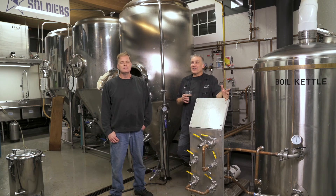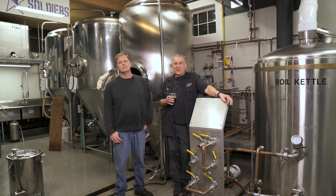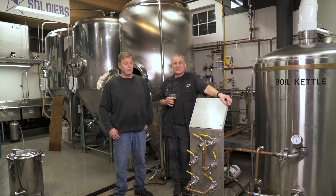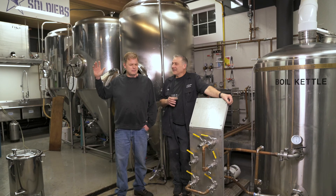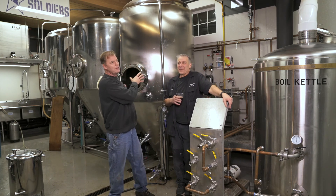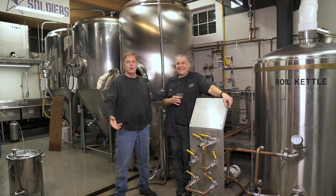So this was a quick overview of what we've done as far as piping here, and we can get into a little more detail later on. We'll do another video if you'd like to see more in depth. Drop us a line if you want to go over the diverter station. There's a lot of things with the brewery process. We have a five-ton glycol chiller with a pump — that's what keeps all this stuff cool. It cools our wort down to 68 degrees from 212 through the heat exchanger. Maybe we can go over that stuff too.